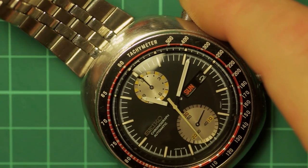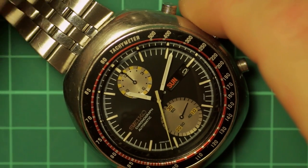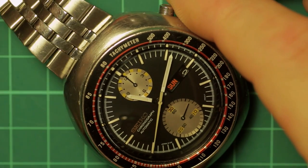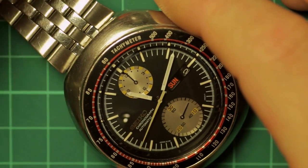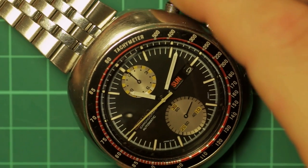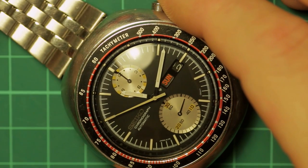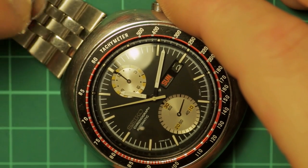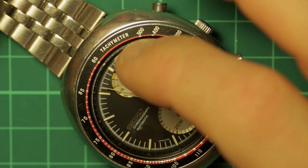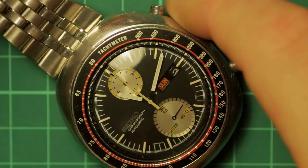The watch has been running now for 24 hours with the chronograph running up until the point where I just reset it, as you saw a second ago. And checking the time, it is keeping time very well. So I'm really pleased with that. That's with the chronograph running, sitting in dial-up position. Obviously with the crystal replaced, that will resolve the problem with the very, very slight amount of drag in this sector right here, as mentioned.